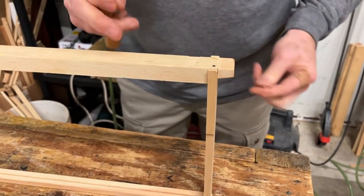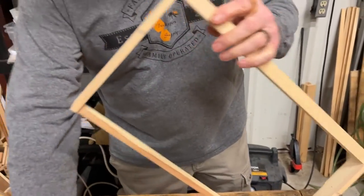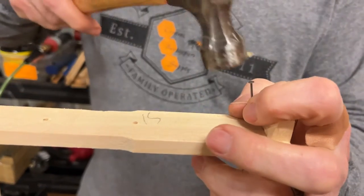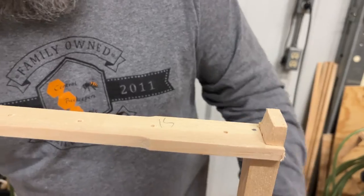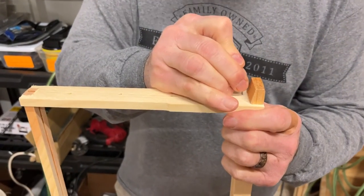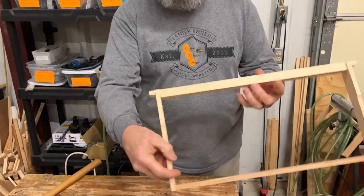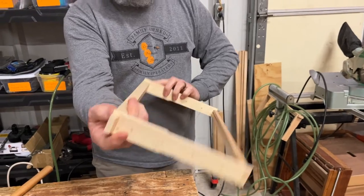These little wire nails are great fasteners but they're easy to bend, which is why you use a hammer that you can control. That's eight nails — we just put in eight. I'm going to drive the 9th and 10th. This is the most crucial nail on this frame — it goes under the end of the top bar. Drive that nail in solid. When you flip that bar over, make sure you're on a solid surface on the corner where you can overhang that bar.